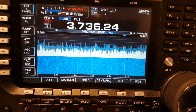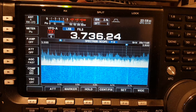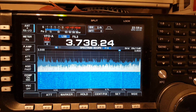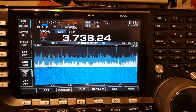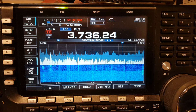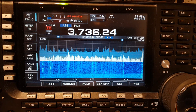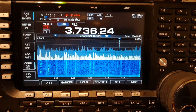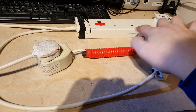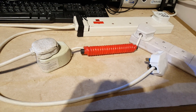If I then skillfully plug the radio in without killing myself through the filtered socket, and then unplug the original unfiltered supply, you can see the difference in noise almost immediately. You can see that the S-meter has dropped down to S2-ish and there's a big step on the waterfall. So to show you what I've done — the unfiltered cable is now unplugged and the radio is drawing power through the filtered power cable.